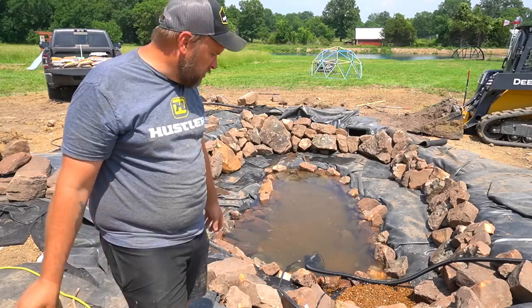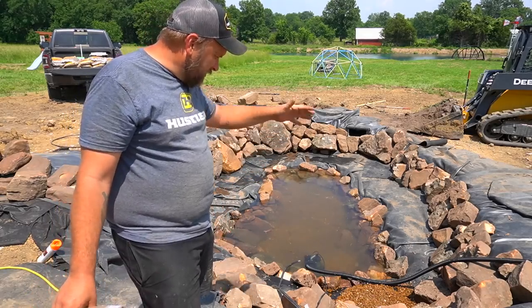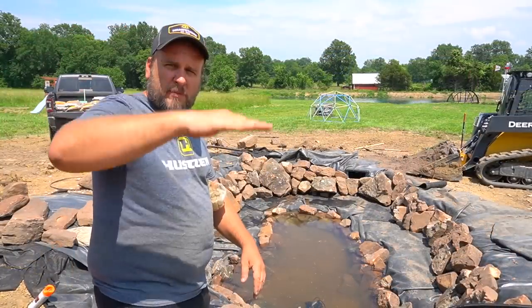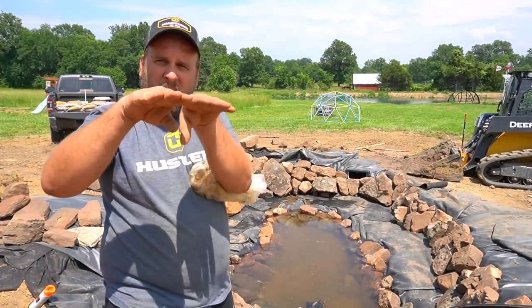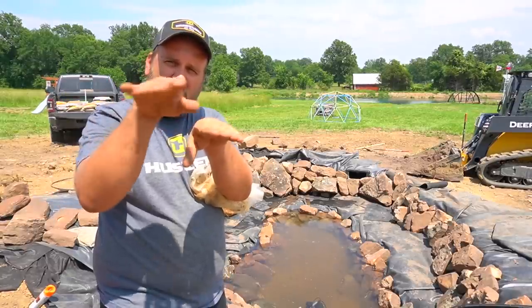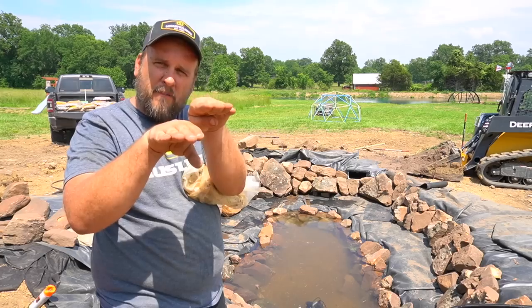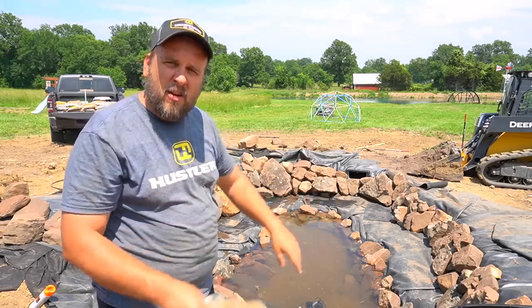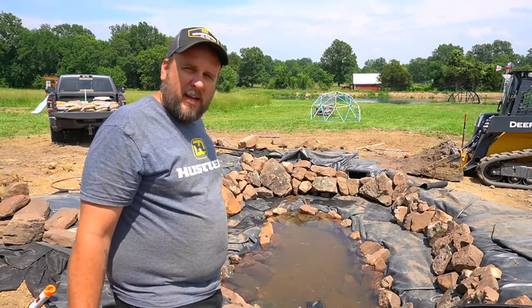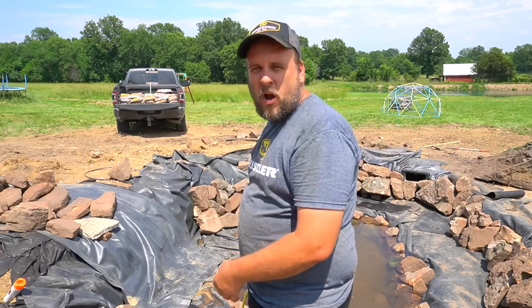Trying out a process tells you what's wrong with it. As I dump one bag in there, I can see that river rock's all gonna slide down into the bottom. So the pond drops down to a shelf that's about this high, and some of our rock is not quite as tall as the shelf. And that means that's all just gonna spill over. I need to put another ring inside there of small rock that sticks up above the shelf to hold that river rock in. So I guess that's what I need to be doing right now. I'm also gonna turn the sump back on and let it pull out some of that junk at the bottom while I'm finishing this rock ring.